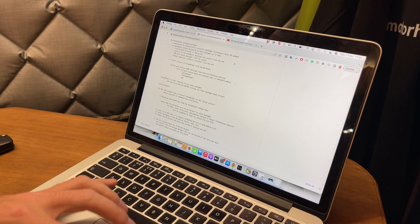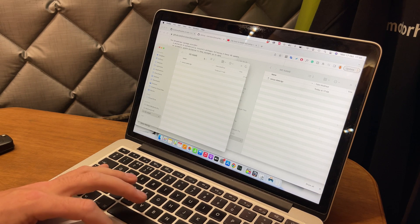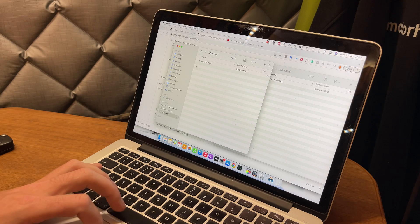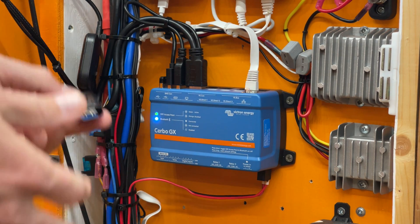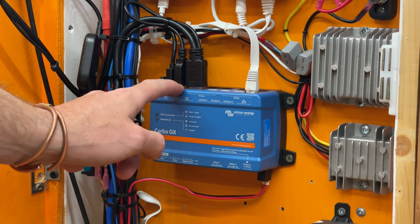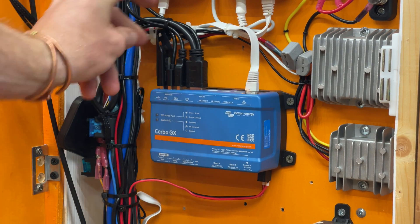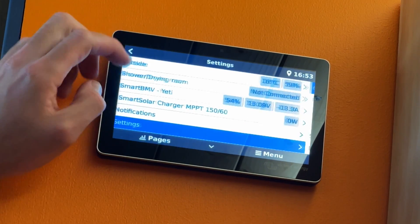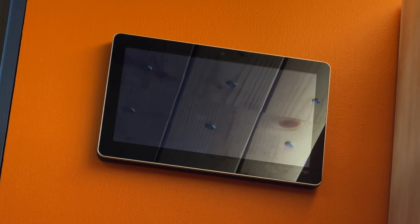Download what it says you need, which I've already done, then paste it onto a freshly formatted USB — formatted in FAT32. Download the package, don't unzip it, just put it straight on there. To install it, insert the USB and reboot twice. You can only use the data USBs — the third one near the HDMI is a power USB — so I'm just going to take out my extra Bluetooth dongle and put the USB in.